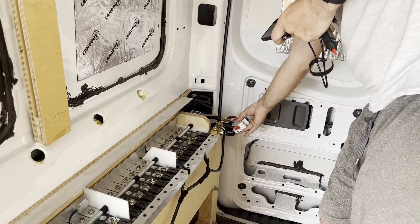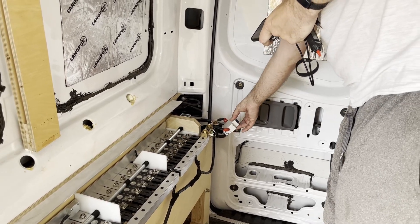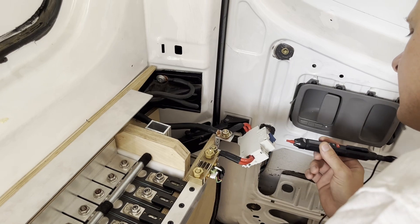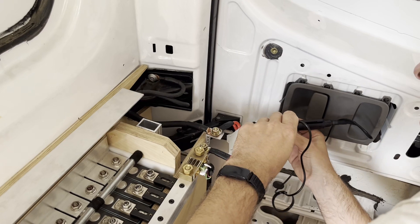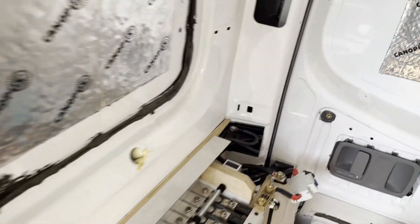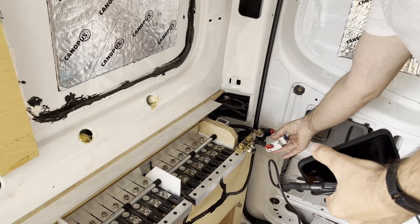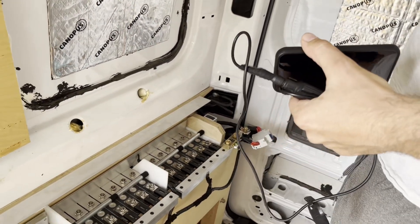It's getting very hot but it's not breaking. At 136 millivolts and this current level we're dissipating 16 watts — this is going to start to melt pretty soon. At 176 millivolts it's basically 21 watts, becoming its own little space heater. Something cracked inside of it... and it broke.